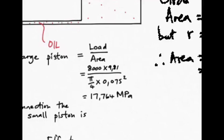and press it. Immediately it says 17.764 times 10 to the 6. The reason it says ENG is that it is the engineering button. In engineering we often use kilo, mega, etc. In this case times 10 to the 6 is mega. So by pressing ENG once, it has presented me the answer in a format useful in engineering, namely 17.764 times 10 to the 6 of the base unit, pascals. So I can then immediately write it as 17.764 megapascals.